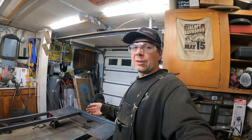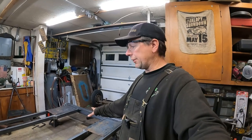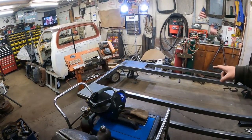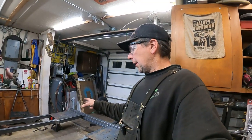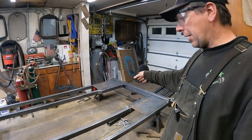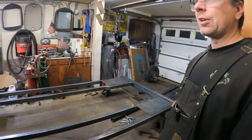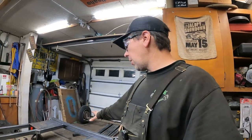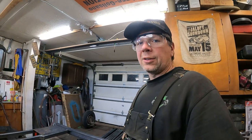I'm going to make this still have the drive-on action but also function as a utility trailer. I'm going to burn on these diamond plate pieces. I don't want this video to be 17 hours long so I'll skip a lot of the welding. After that I'll make a front cross member to tie the tongue into, then get the axle over here with the new mounts, put the little pieces on the bottom for where the wood attaches, and then figure out how to flip this thing right side up.